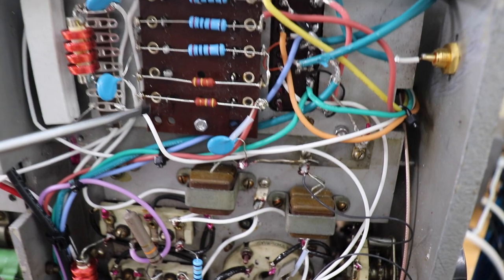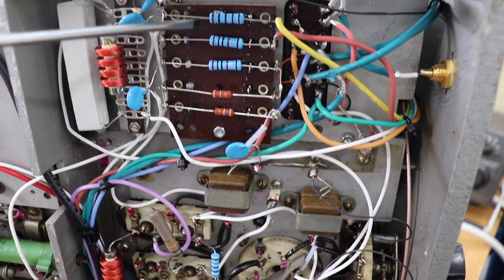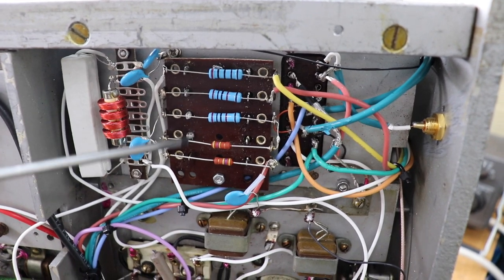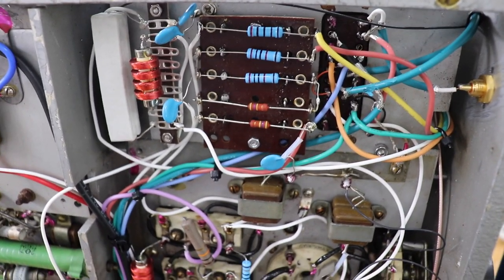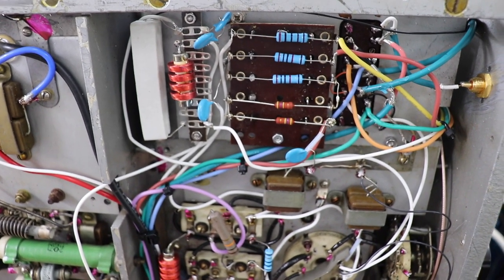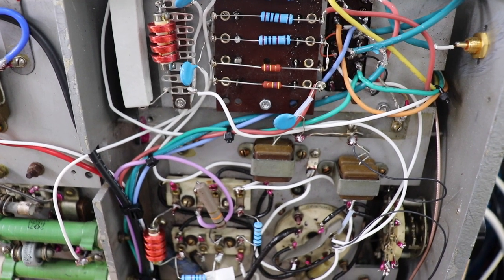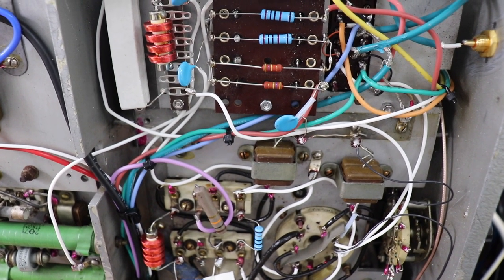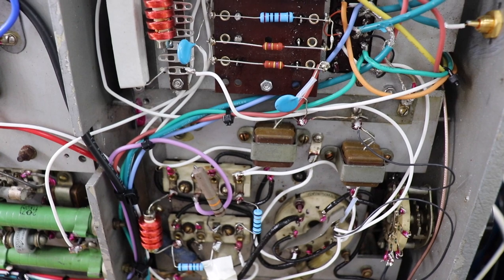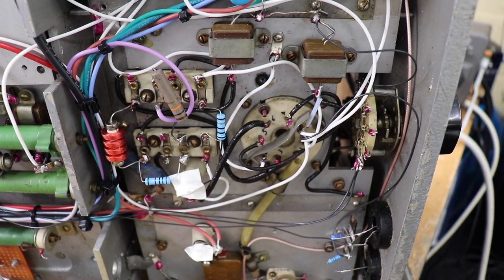And there's also a resistor up there, you can't see it, which is a resistor, I don't know, 20 ohm or something like that, in the cathode circuit of the GU50, which is for measuring the cathode current or anode current. It'll be about the same. What else?